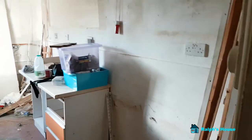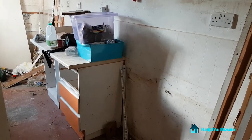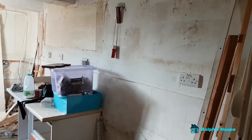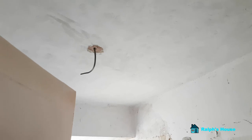So that's kind of the plan for the kitchen. Jimmy said get the tiles off and then give him a shout and he'll come and have a look and see what he thinks — to get it plastered out for me. I could get all these sockets in, get all the electrics done. I've already got a cable up there. You see what I mean by dropping cables down from the floor above — that was one I did for the lights. All I've done there is just drop one single cable, so at least I know I can power a light fitting up there, even if I haven't connected it on the next floor yet.